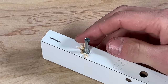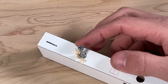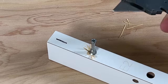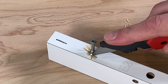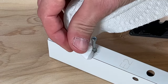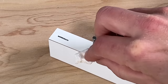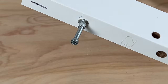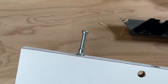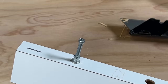The real hold will come in 24 hours when the wood glue completely sets up, and that will securely hold the cam screw within this piece and give it the strength we need. Trim off those slivers with a utility knife and wipe off any excess glue, then let it sit for 24 hours before assembling it back into the furniture.